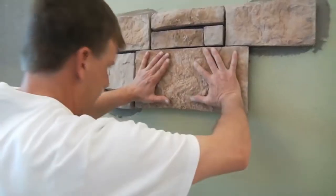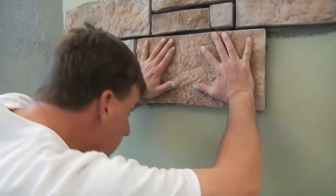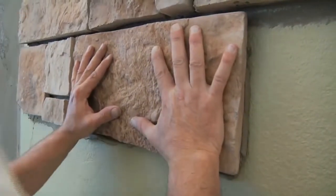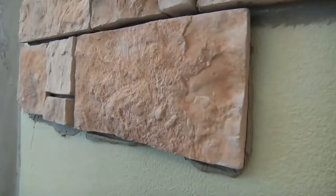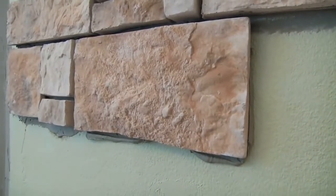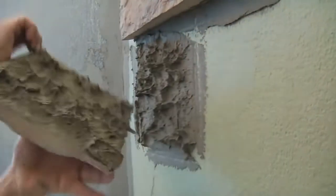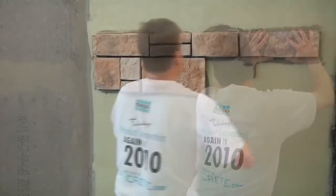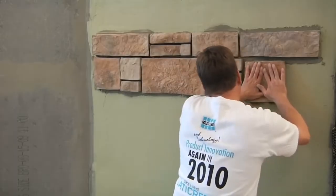Press the mortar-covered back of the stone against the substrate at the desired final position. Slide the unit roughly one inch diagonally from the desired final position and then back, while maintaining even pressure. This should be done in such a manner as to squeeze the mortar to fill the entire space between the unit and the substrate, allowing excess mortar to extrude on all sides of the stone. Clean the excess extruded mortar with a trowel and spread it onto the next piece to be installed. Check the veneers periodically to ensure 100% coverage as per code. The benefits of using LATICRETE Masonry Veneer Mortar compared to a basic Type S mortar include non-sag performance and exceptionally high bond strength, in addition to allowing for veneer adjustment and cleaning without any subsequent sagging.